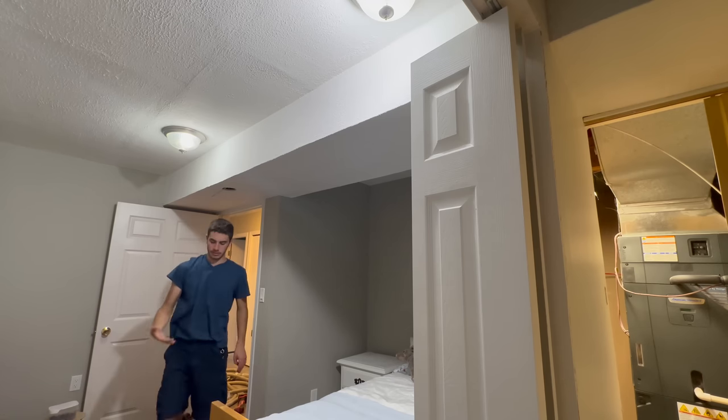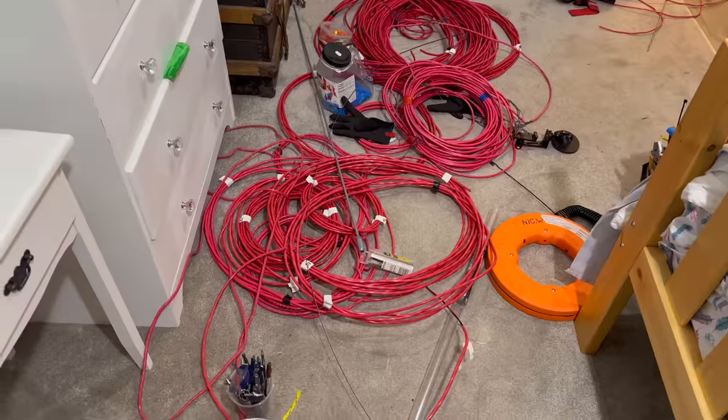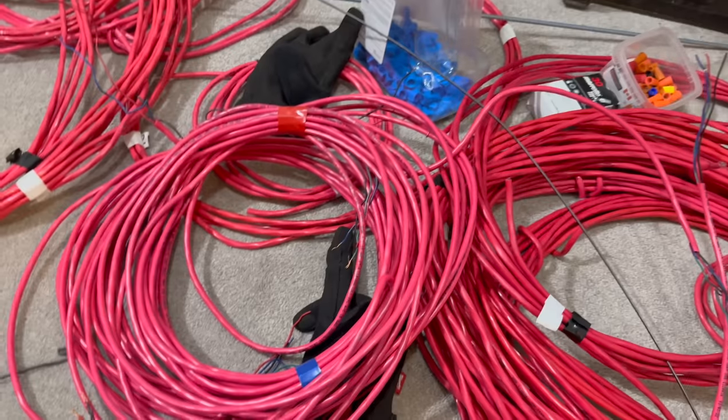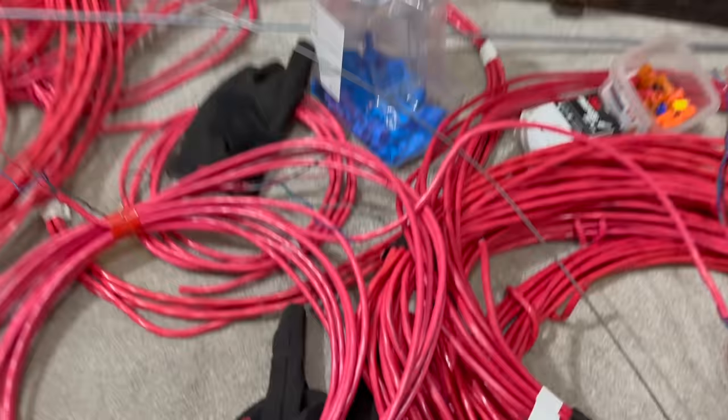Okay, that's probably there. Yes, it is. We are more than there. We are there and then some. Man, I was going to the neighbor's house with this thing. This one we'll need to run an actual 5-conductor because I use the 4 conductors in place of a 3-wire since they have the blue I just won't use. But if you use the green, then you don't have equipment ground. So we can't really use them for ones we actually need 4 wires.